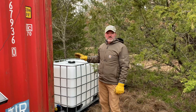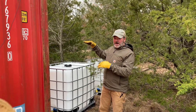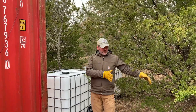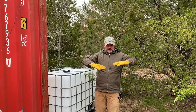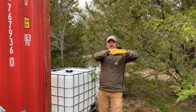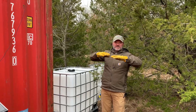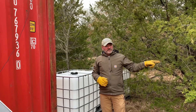We have two IBC totes: one will permanently sit on the trailer and be elevated higher than the one on the ground. When rainwater comes in from the overhang we're building, it'll flow directly into the one on the cart, which is connected to the one on the ground. As it fills, water flows into the other one, and they rise together. Once the ground one tops out, the trailer one will only be half full — so it won't exceed the trailer's weight limit.